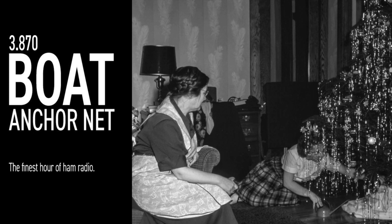Anyway, we're just running the standard Kenwood TS820, and we're driving a homebrew single 400, about 600 watts. I need to do something about my tuned input. I can get about 750 out of it, I believe. Anyway, the microphone is a Kenwood MC50. The antenna is a 2-band bazooka up there about 35 feet.